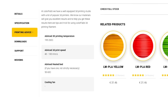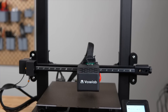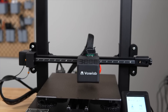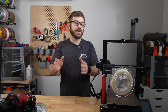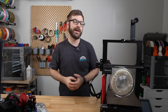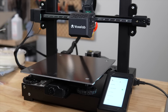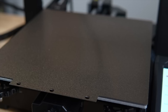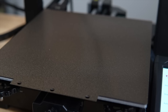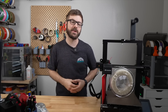Now let's look at the requirements for printing with this filament. I'm using the VoxelLab D1, which is an i3 style printer with a direct drive extruder and an all-metal hotend. Since this filament is based off of ColorFab's PLA-PHA, it does not require an enclosure. The D1 has a powder-coated PEI bed, which is my personal favorite solution for most filaments, and lightweight PLA is no exception. Most build surfaces will work fine, and the temperature I recommend is just the standard 60 Celsius for PLA.